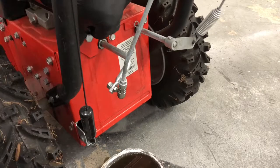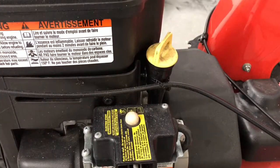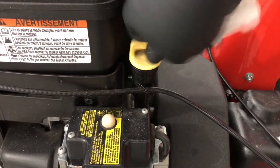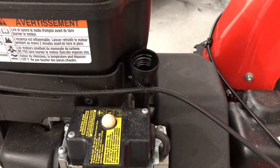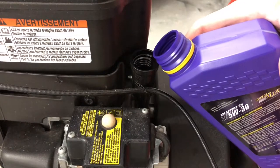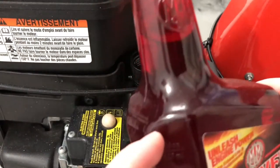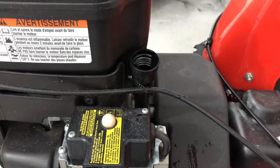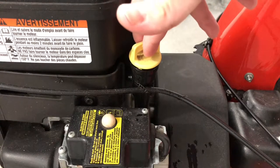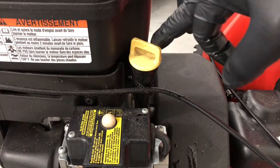I have it tilted backwards to make sure all the oil gets out of the engine. Once all the oil is out, tighten the drain plug back up by hand — don't go too tight or you won't be able to get it off later. Come over to the oil fill valve on the right side of the blower and unscrew it. Keep it clean — no dust or dirt. Pour in 16 ounces of oil, then add the 4 ounces of Marvel Mystery Oil. Clean the dipstick first with a paper towel, drop it in without turning it, pull it straight up — as long as the level is good, you're done with the oil change.